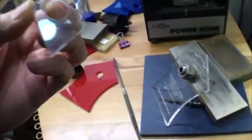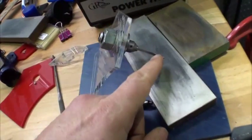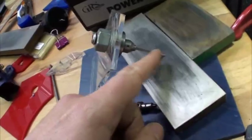What happens with this is I move from that up there, once I've cut the base, which is used in this template. Okay, the template simply unscrews and it moves to this, so you don't need to do the first part again and again and again. You only do it once to prep the graver to the right degrees, and by the time you get down to maybe halfway through the graver, you may need to prep it again. Right, so that's about a half an hour.